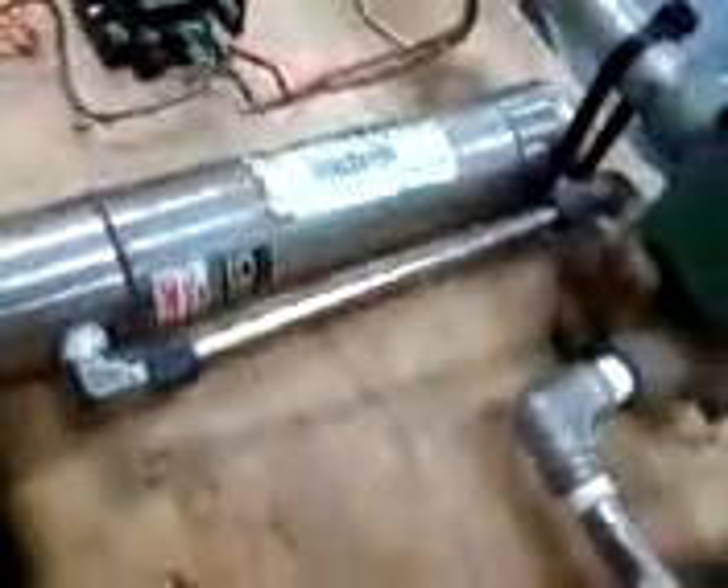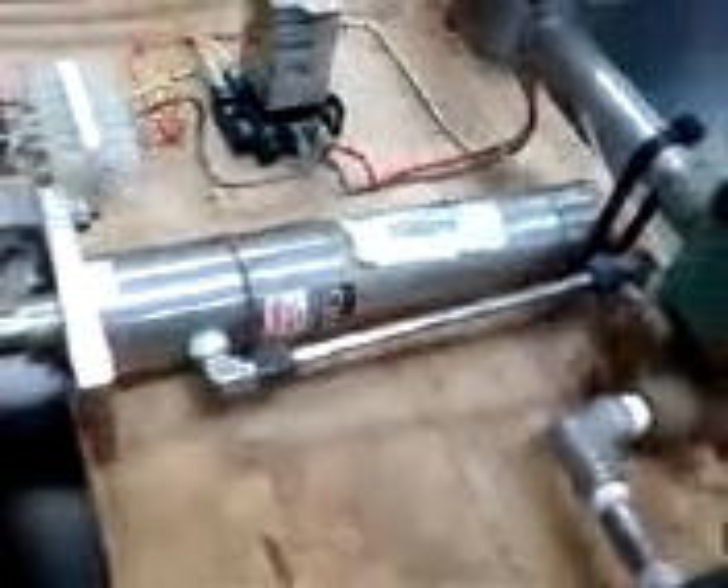The system is moving back and forth quite fast. We haven't yet calculated the speed of the system — something we will do at a later time. The pneumatic cylinder is shown right here. I believe the bore is about 38 millimeters and the stroke on this piston is about 100 millimeters — that's basically the information about that.